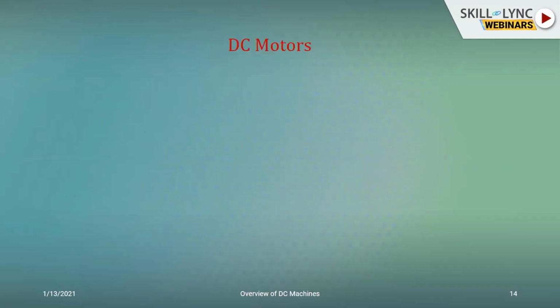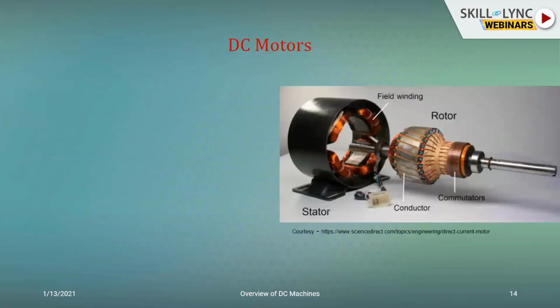The second part of it would be the DC motors. In many ways, constructionally and in the operations behind it, you can find the terms from the DC generator being brought in over here also. Just the operational principle would be tweaked a bit. When I say the terms, the field winding, the rotor, the stator, the commutators, everything are the same, and they are the same circuits that we are importing from the DC generator.